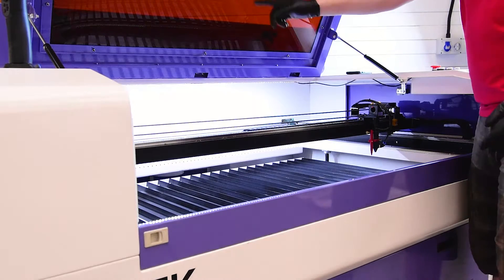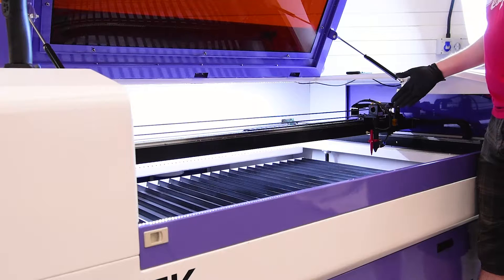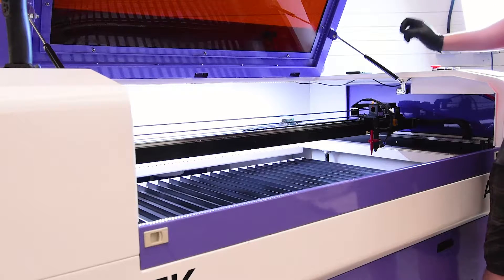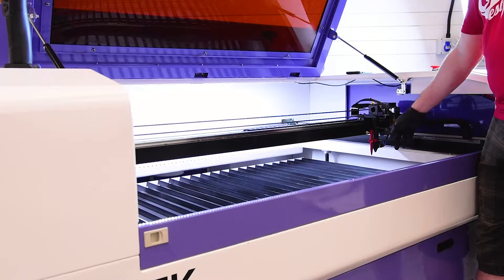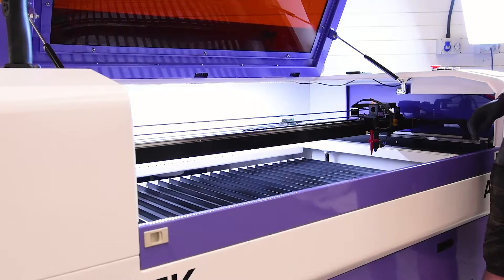The laser path for the infrared laser is mostly aligned now. The red dot laser still needs some work — I should go back over this path and get it perfect. But for now we've got it coming into this mirror pretty well, and now we want to get it shooting down through the main lens correctly and we'll be ready to do some cutting.